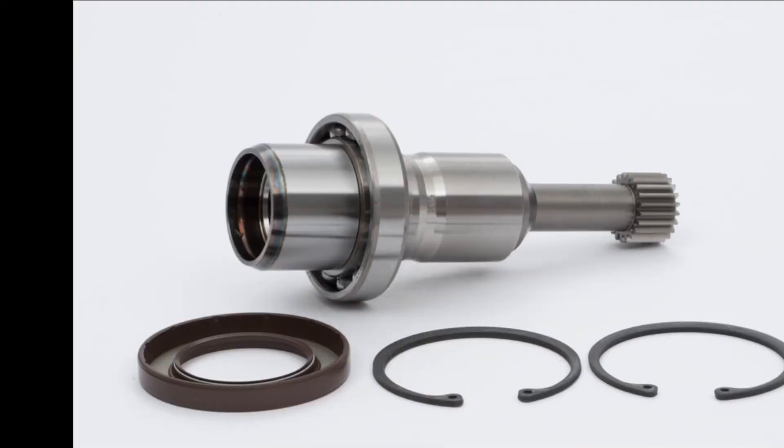And that's really all of it. Putting it back: you put the first snap ring behind the shaft, put the shaft in, slowly aligning the gears together. When you feel it went all the way back and there's space for the second snap ring, that's where you stop. You put the other snap ring, put the cover and snap it on, and you're good to go. After that, put the oil back, put the motor back, and all you have to do is remaster that axis.